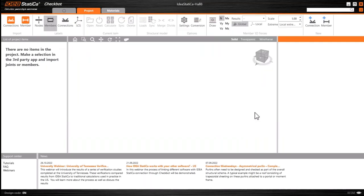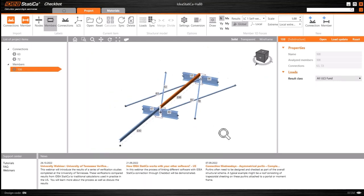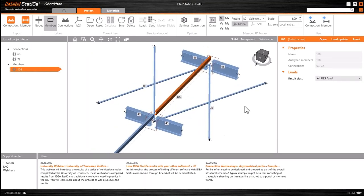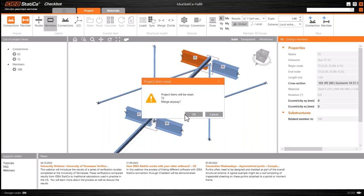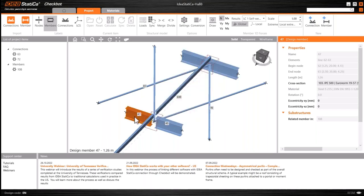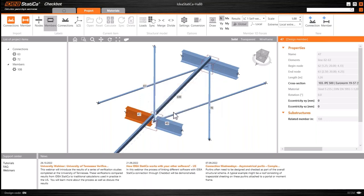This mapping will be remembered from now on, so if we come across that section again in a similar RFEM project it will automatically be imported. Here we see the purlin along with any associated members — the adjacent purlin, the rafters left and right, and the bracing members. However, it's not really set up the way we want it in Checkbot for analysis purposes, so the first thing we want to do is merge our rafters from several discrete portions into one continuous portion.